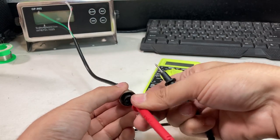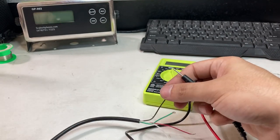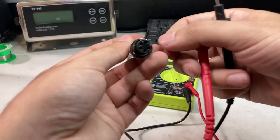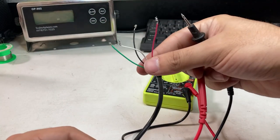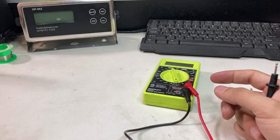Pin 4 is the ground — the black cable — and you should hear a beep there too. There are only four wires in this cable. Yours might have a fifth wire (not the shield cable) — that would be pin 5, but you might not have it; it doesn't really matter. Make sure you test pins 1 through 4. It doesn't matter whether it's a black cable or a gray cable.